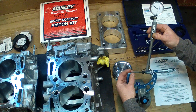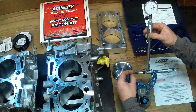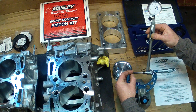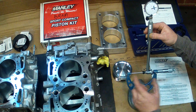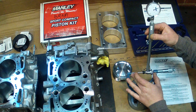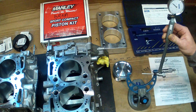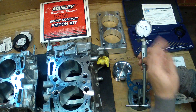You're going to rock it backwards and forwards, looking for the lowest measurement between the micrometer. If I go crooked, you can see it's quite a large reading — up to five thou. As I rock it, it gets narrower and narrower and we're looking for the shortest measurement, meaning it's perfectly squared in the micrometer. As you can see, the needle's touched on zero — I've already zeroed the face to that measurement. If it wasn't, you could rotate the face of the dial to set your zero point.